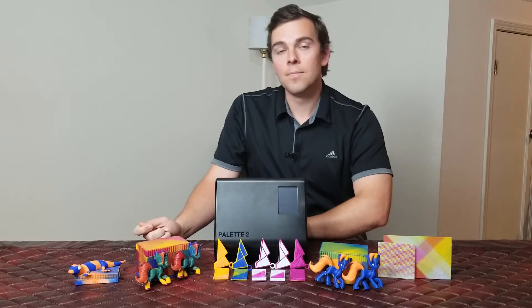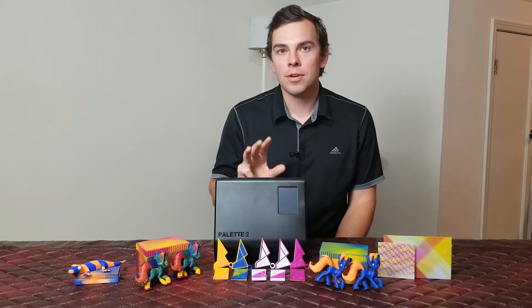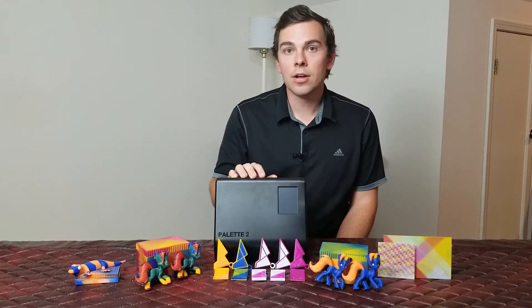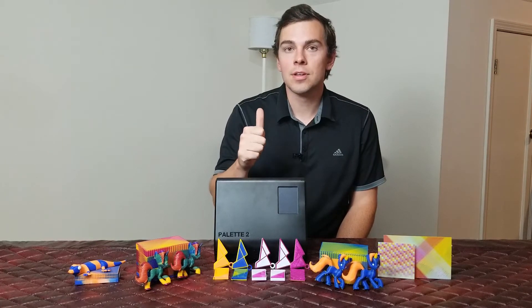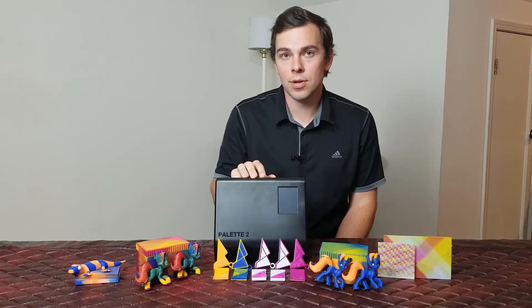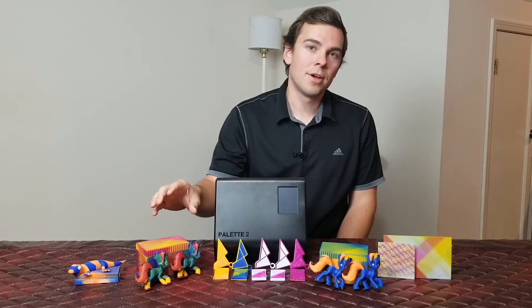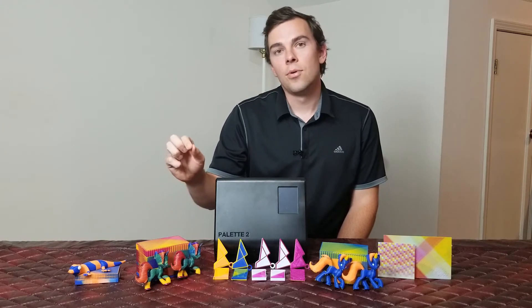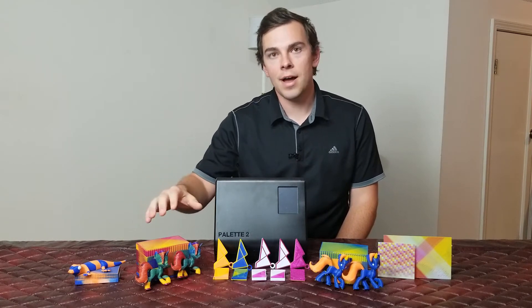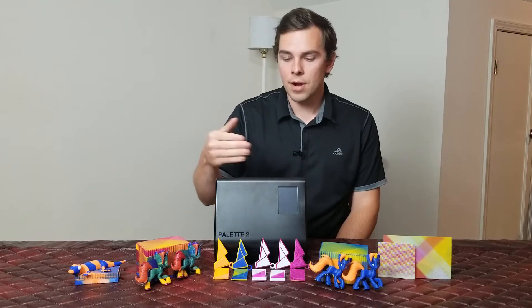The reason for that is my pings and my pongs. The ping is the amount that your 3D printer extrudes divided by the amount that the palette is expecting it to extrude. The pong is the amount of filament that the Palette 2 pushes through it divided by the amount of filament that the software expects the Palette 2 to push through it. With these guys, I had pings of about 95%, which means basically that my e-steps were not yet calibrated. So what I did was I took my e-step number, multiplied it by 100, and then divided it by 95 to increase the e-step. Then I reset the printer profile on the palette and ran it again.